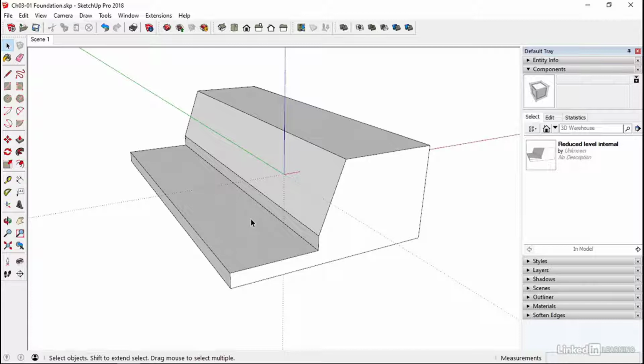So any project that you're working on, whether it's on sandy ground, on rock, then you'll need some sort of foundation, or at least the ability to drill into maybe a hard rock so you can put your building onto it. This one is probably going to be something like medium density clay. We've got a simple strip foundation, and then we'll be putting the CMU blocks and filling those in with concrete as we build up our courses.